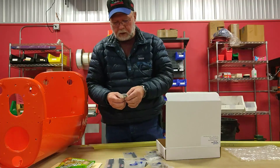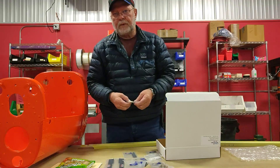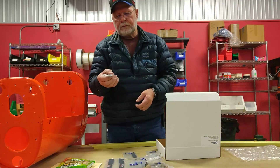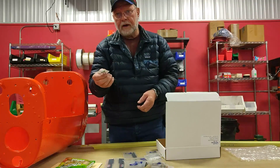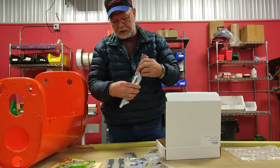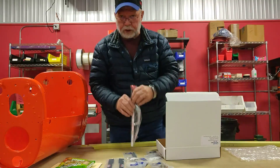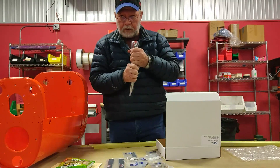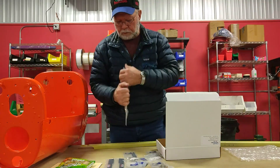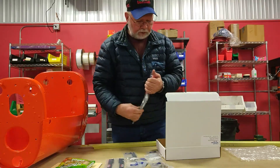And this little cherished 7/32 wrench for the little bitty nuts — I drove all over Caldwell trying to find one. I spent probably an hour and a half trying to find one and probably $50 worth of diesel, and this stupid little wrench costs $4.45 — so if you buy them 500 at a time. Trusty hacksaw. Now I found I like to turn the blade around — this is set to cut on the push, but I like to cut on the pull. It seems like you've got more control pulling it than pushing it.